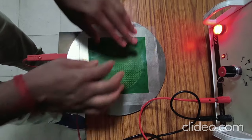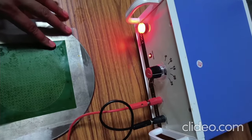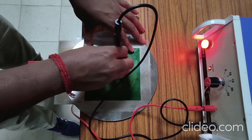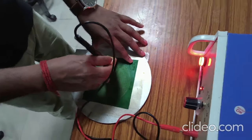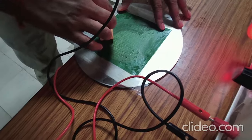This is the third strain path — only three strain paths are shown here. This is a circular sheet. If you deform this sheet it will deform in balanced biaxial stretching, where alpha is equal to beta is equal to 1. The previous one is basically beta equal to 0 for plane strain.